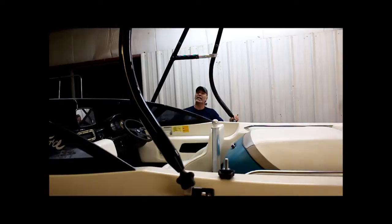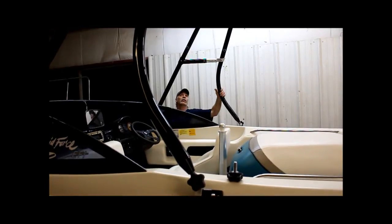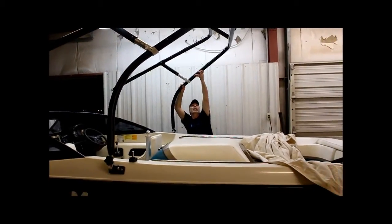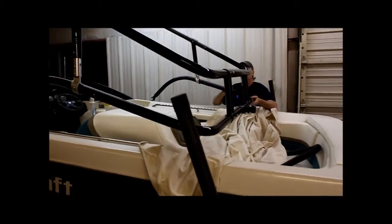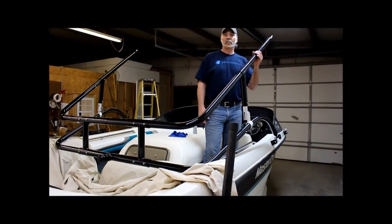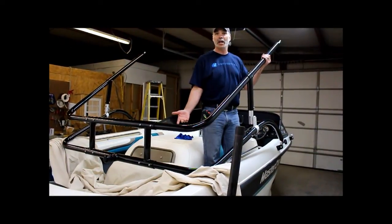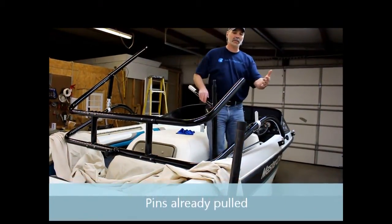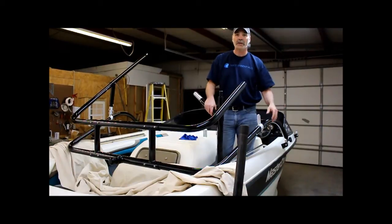Now I'm going to show you how easy it is to lay down. Just release the quick release, hold the tower, and pivot it over. Put a tarp back here to make sure it doesn't scratch anything — just that easy. Now I'll pull the pins and pull the legs out. We've got the tower leaned over, ready to put it in the garage. I know everybody doesn't have a big shop with big doors, so you just pull your pins and slide your leg out. From the ground we're just a little over six feet to right here, probably about two feet from the mounts — you can get in a residential garage now.